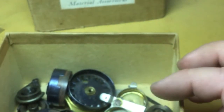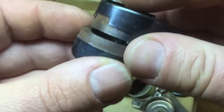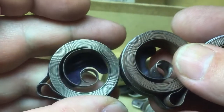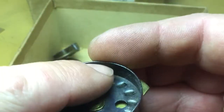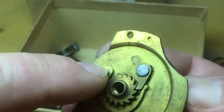The rest of the items in here are new parts not in packages. There's a lot of wear on some of these just from the rust that would have to be removed — the oil that was put on them to protect them before installation has obviously long since dried out. Some of these springs look longer than others. There's what an older style barrel would look like with the brass bridge with the holes, but this one's got a broken hook. Somebody has drilled a hole to access the rivets — you can see the punch marks there to tighten up these rivets.